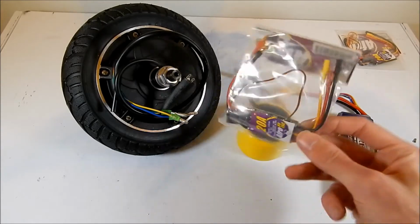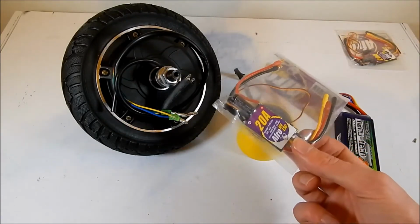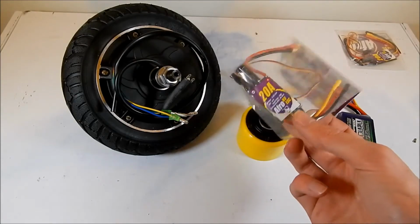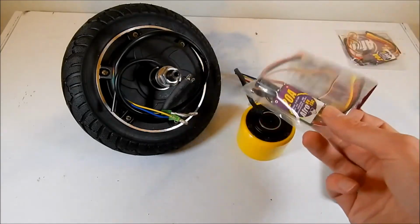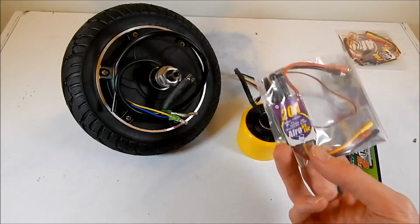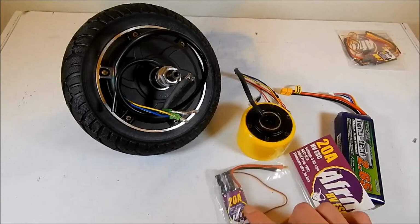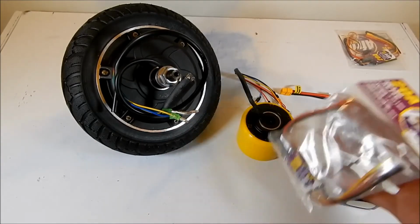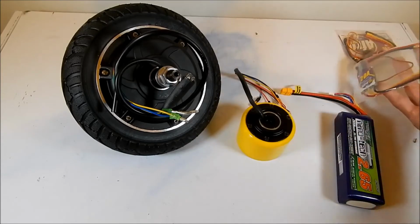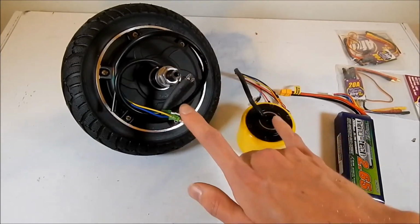So that's the motors and the batteries, and then sitting over here in the corner I have these neat Afro speed controllers from Hobby King. None of this stuff is sponsored, by the way. I buy all of my stuff for myself. And yeah, these speed controllers are 20 amp, but they are high voltage, which means they can run up to 8S. So both of these motors, I think, if I've done my calculations correctly, should be able to run on the 20 amp speed controller, this little guy at 6S and this guy at 8S, respectively.